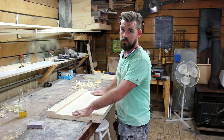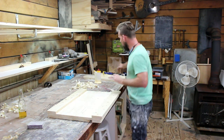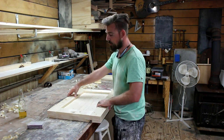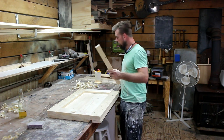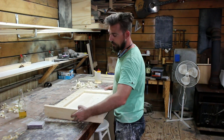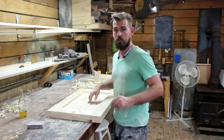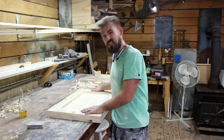Now it's time to start applying the faceboards. Everything going on the face: we're going to have two boards going across the sides, and two twelve-and-a-half-inch pieces going across the top and bottom. Those are going to match up with our nineteen-and-a-half — one small piece going right across the bottom and a big one going right across the top, and that's your door. Once that's done, our final step is going to be attaching the cross braces, and I'll show you how to cut those once I get all this stuff on.